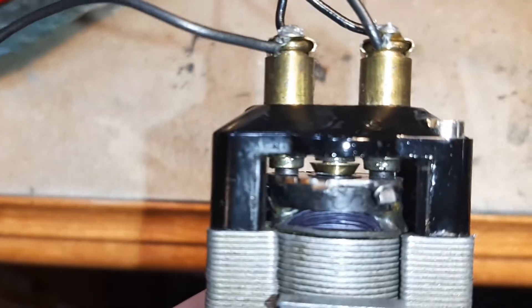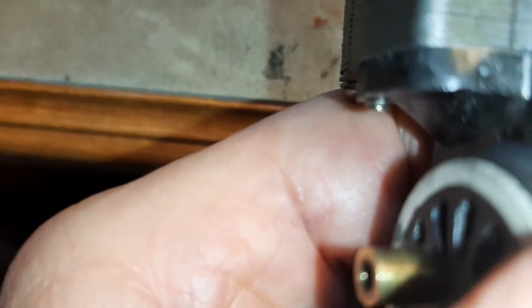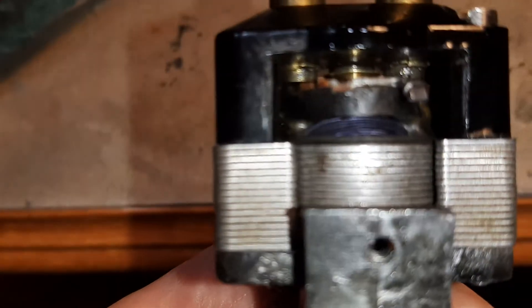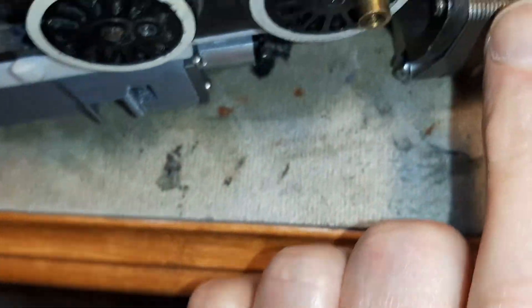See it? It's about five thousandths clearance, that's about it. But that's about all we really wanted. That gives us a much smoother operation. The other thing I changed was the armature I had selected was the wrong plate width.